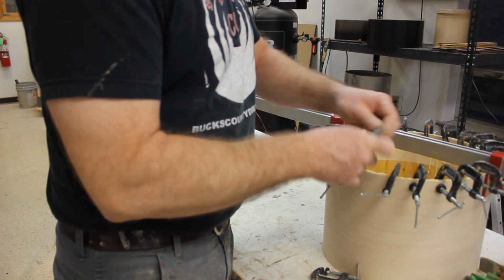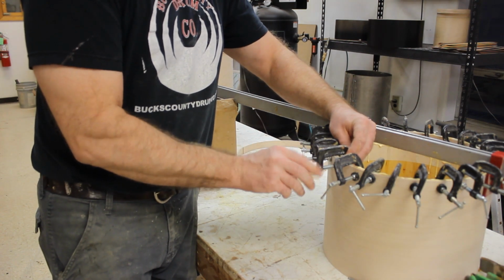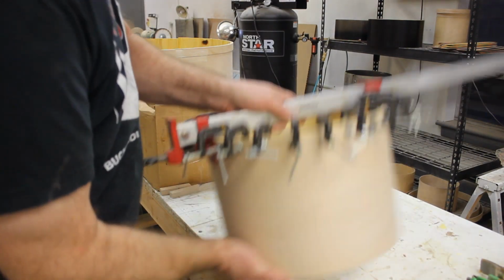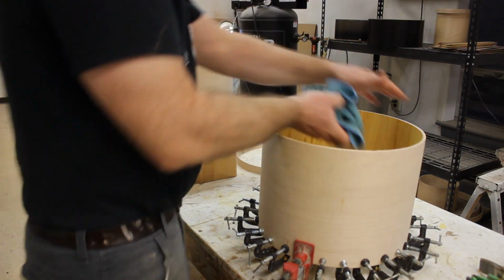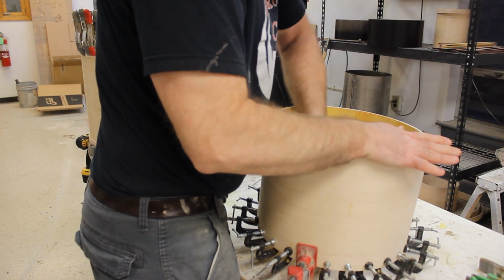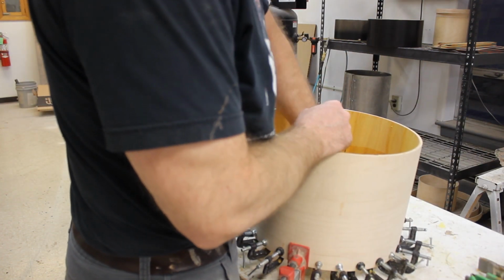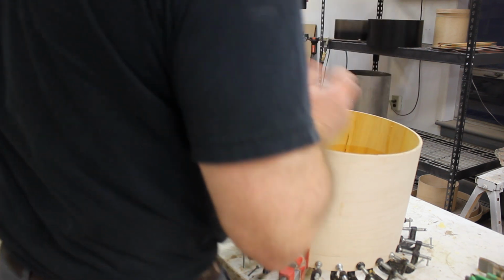Get in our own way really quick in this place. And one more here. And that is already cleaned up. This, took our wet rag here. And we just wipe all the glue off. Yes, we're going to sand all these. It's a lot easier to sand. Otherwise I'm going to have big thick lines of glue dried in here. Alright, and I'm going to take this, pull the tape out before the glue dries. Otherwise it'll be difficult to get out. Dries in place. And we wipe this out one more time.